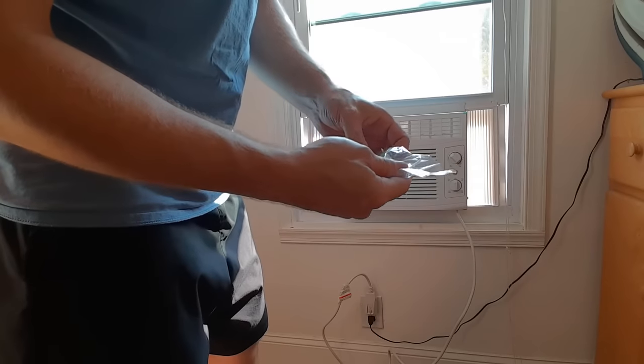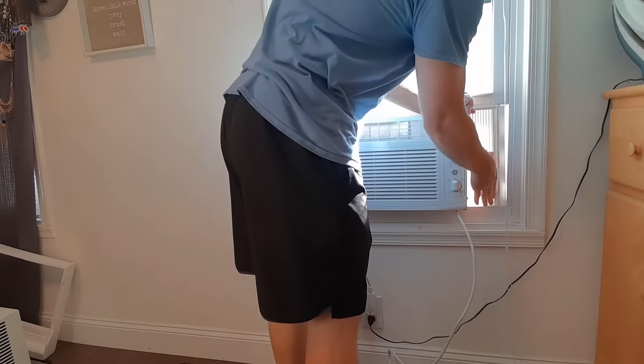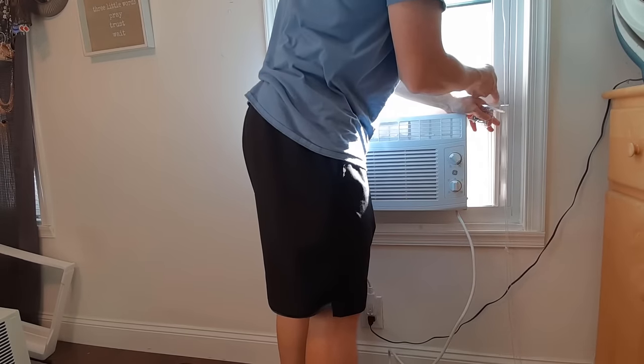They provide a series of brackets and screws depending on how you want to secure the unit. Most of the time you just take a screw and put it through the window frame — make sure it's not lining up with the glass or it will break. On most wood and vinyl windows it's far enough away to use that screw hole. For older wooden windows you can screw right into the wood. For a replacement window like this where there's nothing to screw into, I personally just use packaging tape — it gives a nice seal and holds it in place. If you're in an area prone to burglary, you can also place a block of wood above the window to keep it from going up, or get it screwed in to prevent entry.